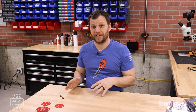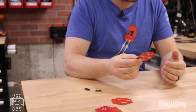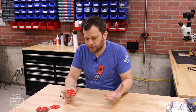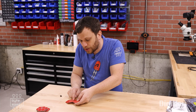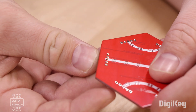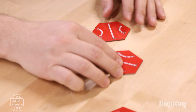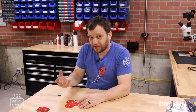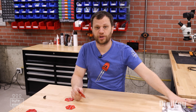It's been a few days and the PCBs have arrived — I'm really excited because they look awesome. It doesn't matter how many times I've ordered PCBs, I always get excited when they come in. The first thing I'm noticing is some things I'd change in the next version. The silkscreen on these paths doesn't go to the edge of the board, which would make the path a little clearer — that's a minor change for revision 2. The bigger issue is the footprint for these connectors: when I insert a connector there's a little bit of wiggle room. For this project I really need the PCBs to fit together precisely, and if I solder the connectors in even slightly off it might introduce gaps at the edge. In the future I'll tighten the footprint so connectors don't wiggle. Other than those two things, these boards look great and I'm ready to start installing components from DigiKey.